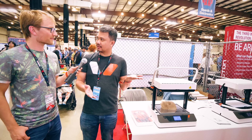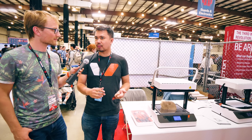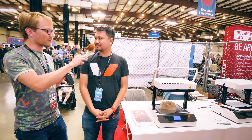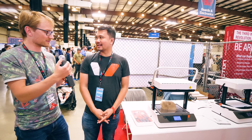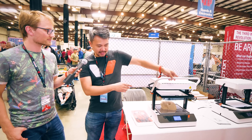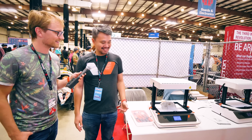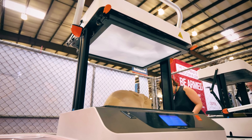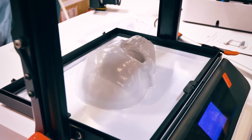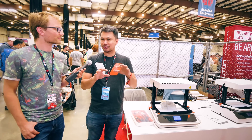There's an aftermarket screen we're developing so that if a child is around the vicinity of the machine, they can't put their hand in there and hurt themselves. We are working on our CE and FCC certifications, so it's going to be safe. And if you don't have any material in there and just heat it up, it's also going to sense that and not heat further. That's correct - if there's no material in there and the heater is on, the software is going to detect that it's not ready. It's about ready to go now. We use a two-stage vacuum system: one for high airflow that takes out most of the air, and then a second vacuum that squeezes out the last bit. It gets really tight at the end - it's actually four times more powerful than a shop vac.